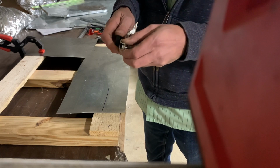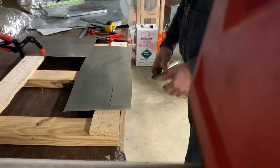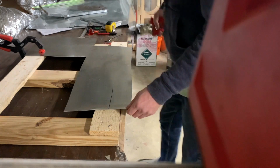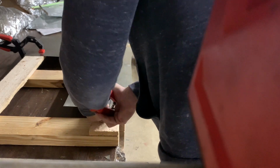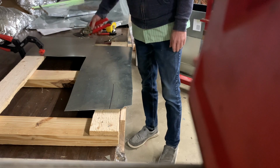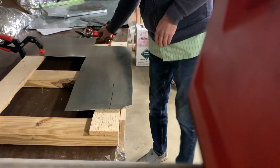So I typically leave this set at the 1 inch mark because that's a common dimension that you need. So just set it against the metal and you're able to make your marks. And so that will allow you to notch out for an S-lock or a drive or whatever. So that's a very nice tool to have, this Malco. A60 is the number on it.